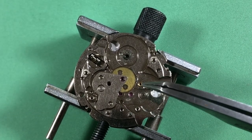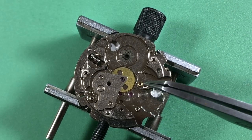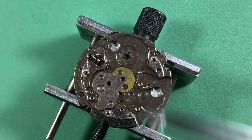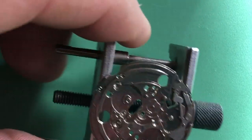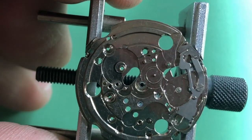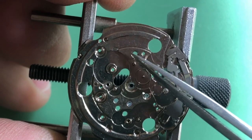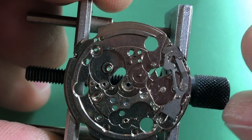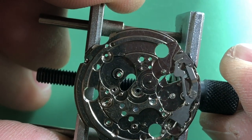Interesting — I don't know why this screw port is brassed out and the other one isn't. Looking at that lower mainspring arbor bore — it's ovaled out a bit. You can see it's blown out; they oval out like this. Not a lot — believe me, I've seen much worse — but it's already moving.